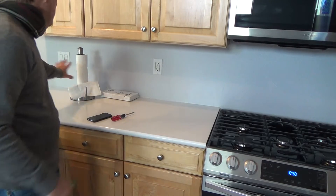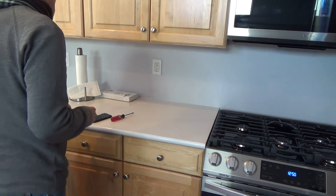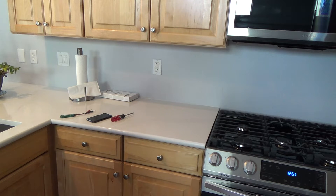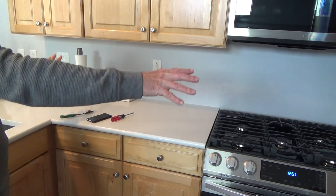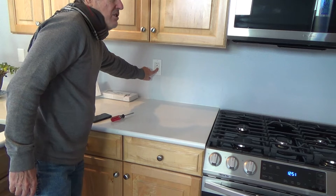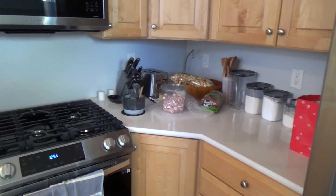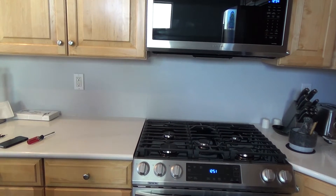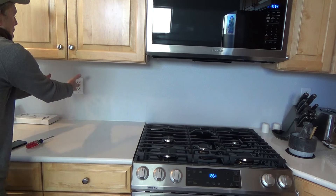I'm going to be installing a backsplash in the kitchen, and before I do that, next time I'm at the hardware store I'm going to ask somebody in the electrical department what they would recommend. I'm highly likely going to hear them say: since you have a 20-amp circuit breaker and all your kitchen wires are 12-gauge, go ahead and change out these 15-amp GFIs to 20-amp GFIs and replace the duplex electrical receptacles attached to those GFIs with 20-amp duplex outlets.